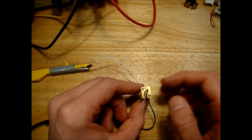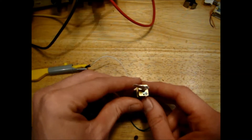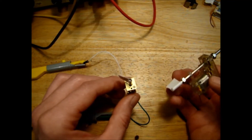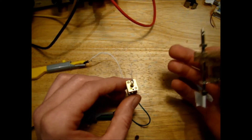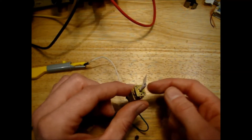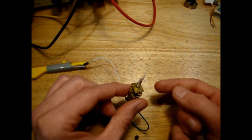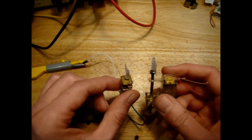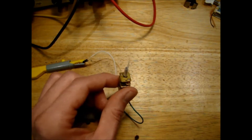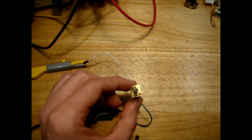We're taking much less current to do the same work than with the other motors. If we can get 75 RPM from one of these N20 motors while maintaining around 15 milliamps, that's a huge power saving and your battery life will last much longer. These are also likely a higher torque motor than the Siku ones, so the motor won't be loaded down as much under load. Starting with a lower current also means a lower stall current.